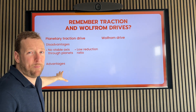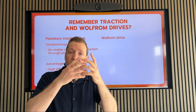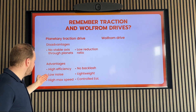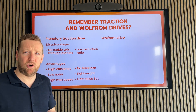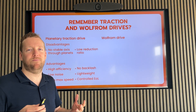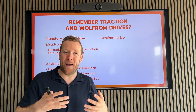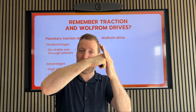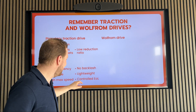Then the advantages — there are plenty. First of all, there's the high efficiency, because the gear teeth don't need to match with each other, it just rolls. And because of the high efficiency, there's also low noise and a high maximum speed, because the lubricant burns or gets overheated way less easily. Then there's the high precision with a lack of backlash that gear teeth have, but rolling elements don't — if it stops moving, it just stops moving. And the Planetwheels are hollow, so it is lightweight.